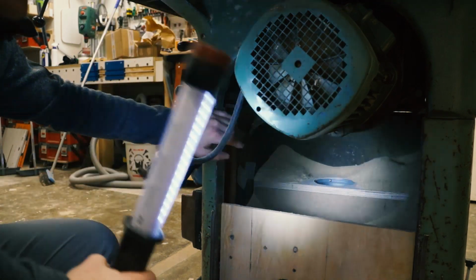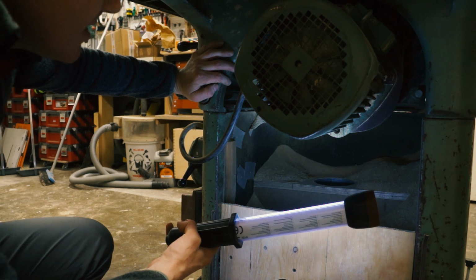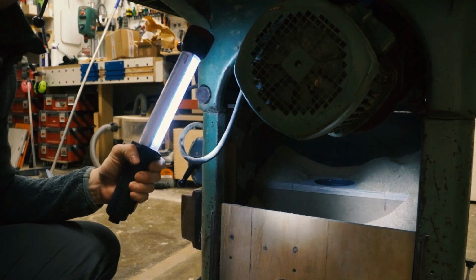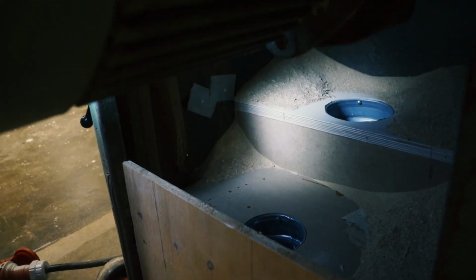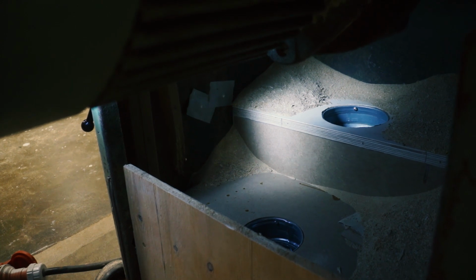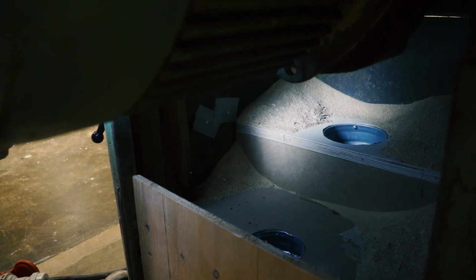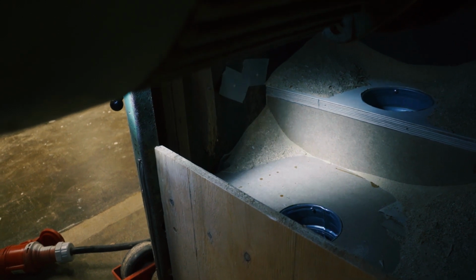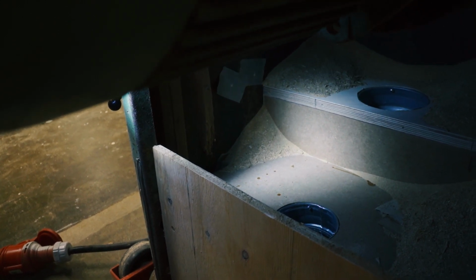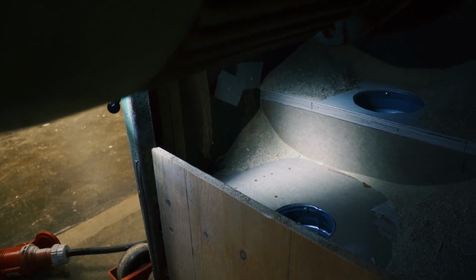So that is the upper chamber, so to speak. I will always leave a bit of sawdust here, because it actually seals the corners of the implementation of this. And down there is the other extractor. So these are connected just to a 100 millimeter system. The one above there is 125. This one is 100 millimeters. That doesn't really matter. This works very well, and you see everything that is around the actual exit is sucked down. So you can't expect much better than this.